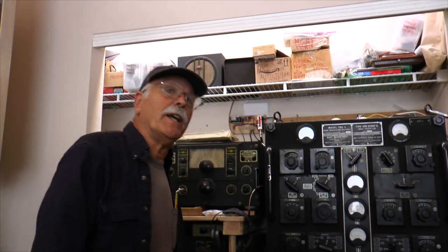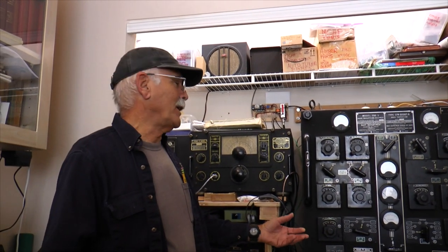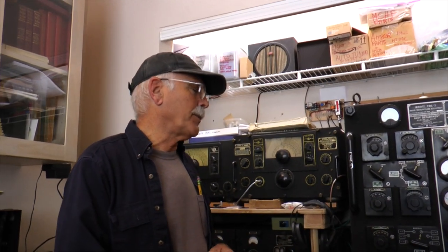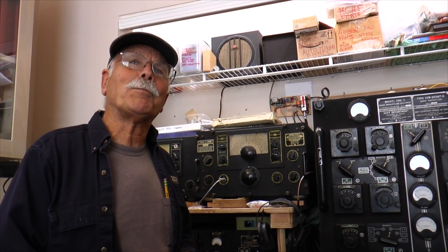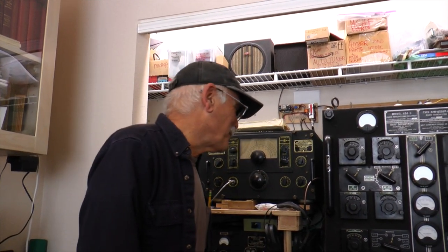They mainly used these on CW most of the time? Yeah, there wouldn't be much use for the AM. Right. And I love this, the manuals would always justify it: to save weight, we're using suppressor grid modulation instead of a full plate modulated speech amplifier. So it's just got nothing more than a low level speech amplifier, one tube that just varies the bias on the suppressor grid. Very cool.